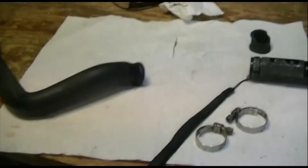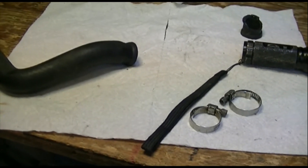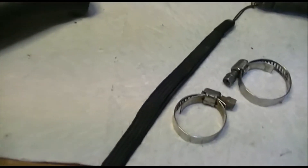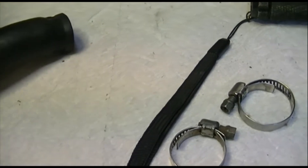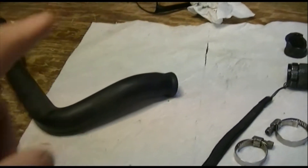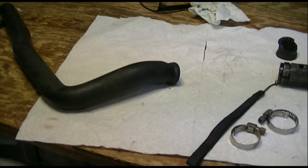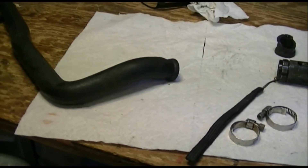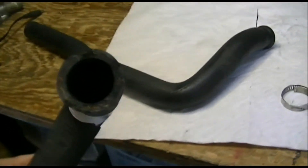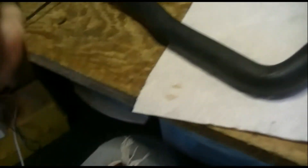We're going to go put it together now. The best clamp there is — I don't know, maybe it's an Aeroquip aircraft clamp or a better automotive kind — has two ends that come around with a screw all the way through it that tightens it, and a smooth band all the way around the circumference of the hose. That is by far the best situation in terms of not destroying the hose with the clamp.